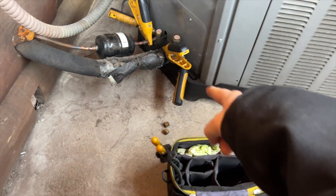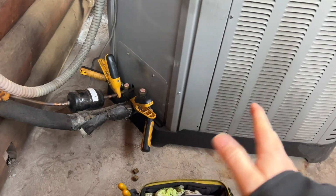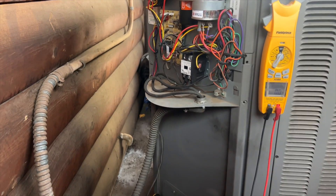I'm going to go ahead and move this to the true suction port just to make sure, but we might have a reversing valve problem. Let's get into it. This is a default-cool system because it's a Rheem.